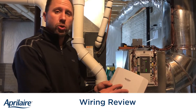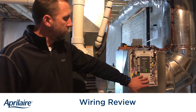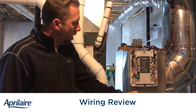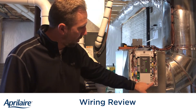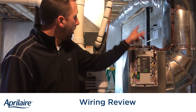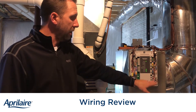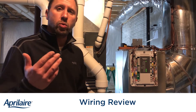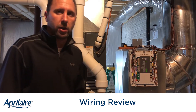Now on the interface control module or the hub, you're going to see on the Aprilaire 6000 series — if you're familiar with our 8920W, it's a very similar layout. As mentioned on the 8140, you can see that I have a simple dry contact vent connection here. In running my two-wire from the ventilator to the hub, I'm able to make the connection very simply. Now we're going to go up to the main control and go into the parameters to set up the ventilation system.